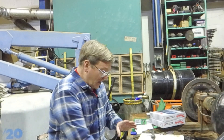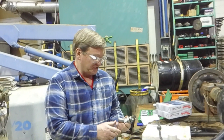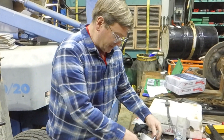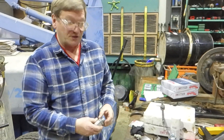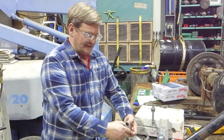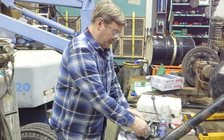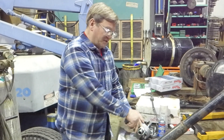Hydraulic pumps are pretty neat — you can do a lot of stuff with them. Also, while we're here, the fittings. This is an SAE O-ring boss, which is a real common fitting you run across. They're good fittings — much better to use instead of pipe. The seal is on a chamfer here with an O-ring. I use them for a lot of stuff beyond hydraulics; they make real good oil drain plugs. This particular fitting, you can adjust the direction and then tighten it down with this nut afterwards so that it seals. When you first put this style in, you want to back the nut off so it's got the O-ring a little bit tight, then turn it in just hand tight.